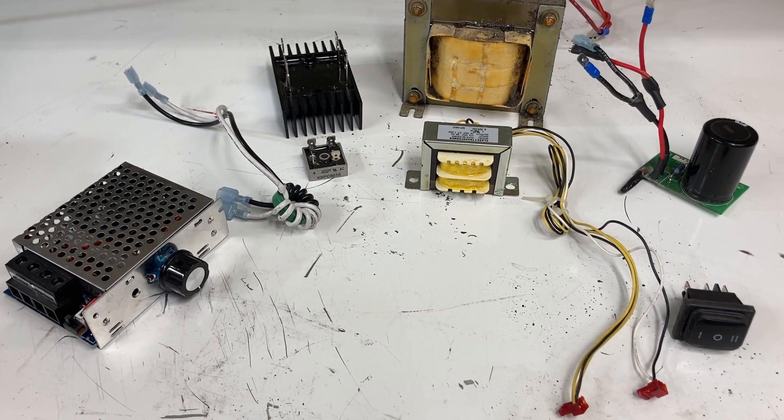You may be wondering why we're using an SCR voltage controller and not a pulse width modulator. An SCR voltage controller switches off and on for AC a bunch of times per second to vary the voltage. A pulse width modulator does the exact same thing for DC. The SCR controller has fewer components, runs cooler, and is cheaper, but it can be a little harder on the motor and the power is kind of dirty. A pulse width modulator works very well but has a lot more components and runs kind of hot. So you have to decide what's going to be the best option for you.